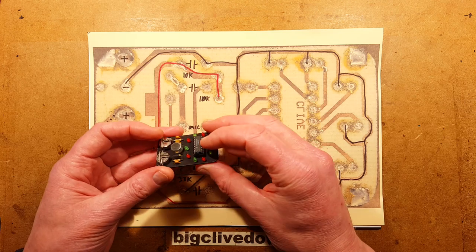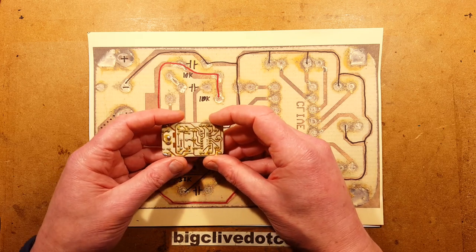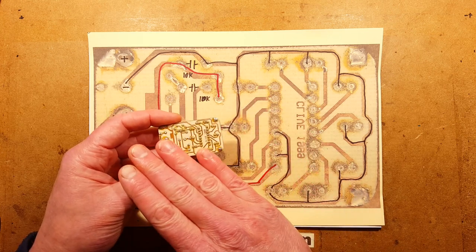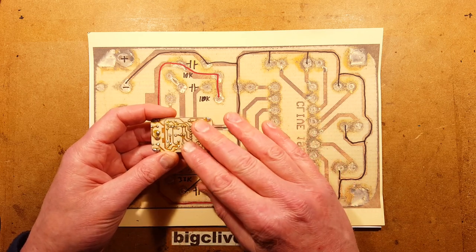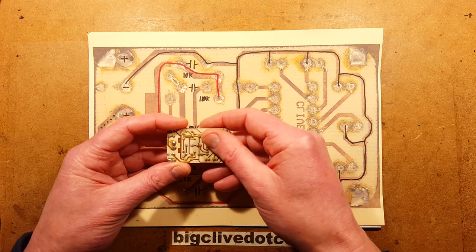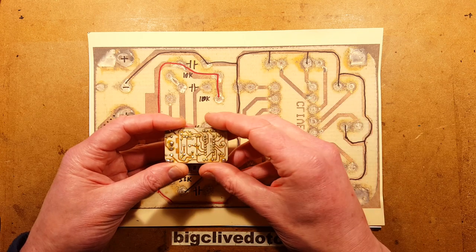So this prototype material, which I don't think is made anymore, used to be supplied by Mega Electronics. It's a layer of fiberglass on the outside with the paper on the inside, and it results in a very white material. Some people have asked about my circuit boards in the past regarding this, but unfortunately it doesn't appear to be as easily available. You end up with that sort of dull, greeny, greyish look instead.